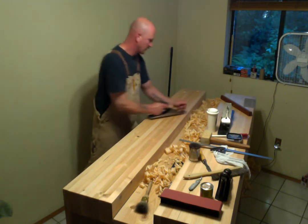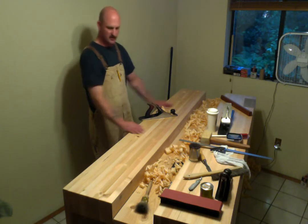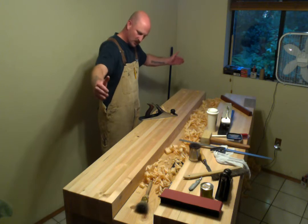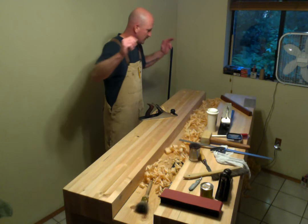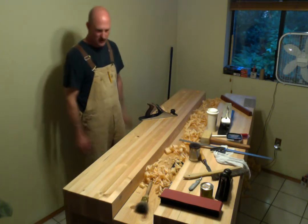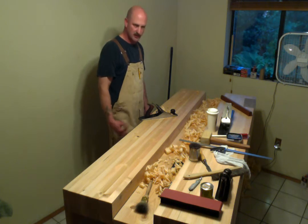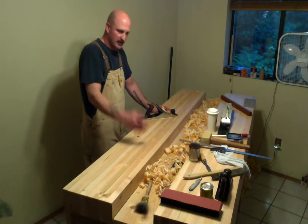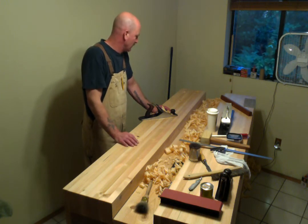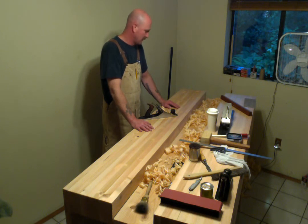The other reason that I need to get the 8-foot and the 4-foot is to use them. So the 8-foot will be mainly for going lengthwise and corner to corner to make sure it's level and no twist and all that good stuff. The 4-foot, I don't need two 8-footers, but I will need something that's more manageable for larger work. So it's shorter but still long, and straight, a good straight edge other than just my drywall square. But something that I can use in conjunction with my 8-foot level as winding sticks, basically, for when I try to treat both of these pieces, both tops, as one piece of lumber. It'll be paramount to have something that spans the entire piece.